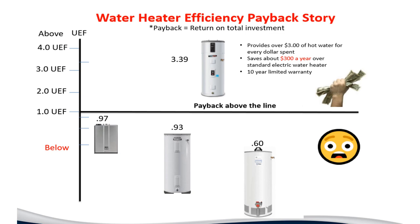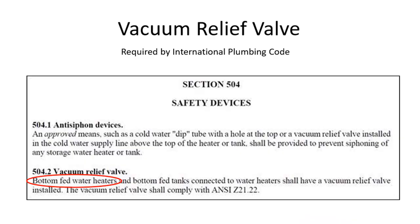All the other ones are just going to cost you more money. Many heat pump water heaters are not traditionally top-plumbed — they are side-plumbed, with cold water entering via a dip tube that injects water at the bottom of the tank. If this is the case, plumbing code requires a vacuum relief valve placed at the highest point in the cold water inlet system for bottom-fed water heaters.